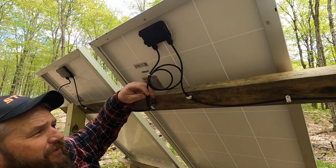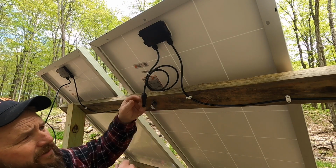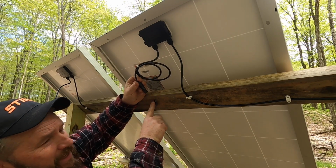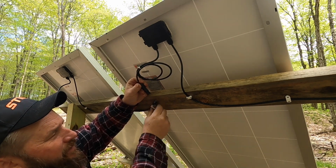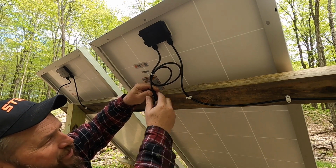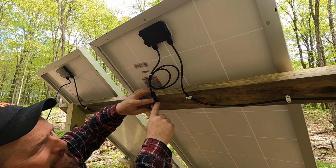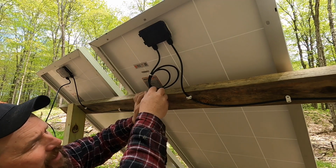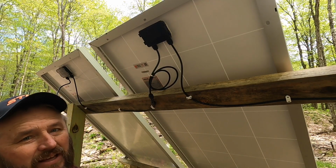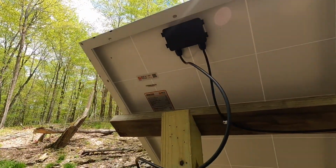Okay, kind of a universal connector for solar is called an MC4 adapter, or a connector. And you can see there's a female end and a male end. On the male end, there's an orange O-ring that's inside there to keep any rain or moisture out of the system. And it comes with 2 locks on the male end that snap into these little grooves on the female end. So it's going to be as simple as just pushing the 2 connectors together. And then now I'll show you the panels itself.